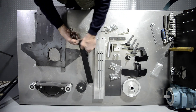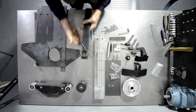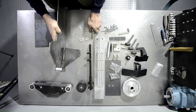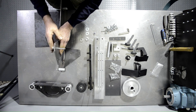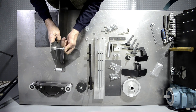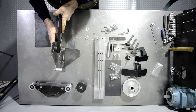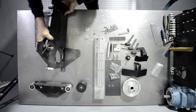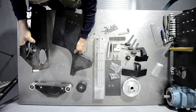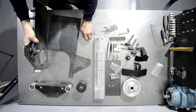We can then install the spring on the swing arm, centering it on the hole. Take the M10 bolt, run it through the hole, then one aluminum spacer, one steel spacer, the swing arm, and reverse the sequence with the steel spacer followed by the aluminum spacer.